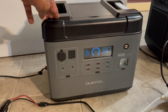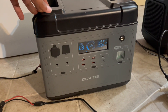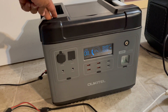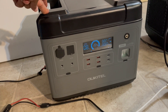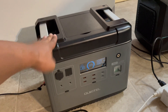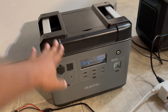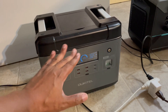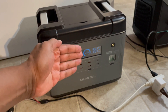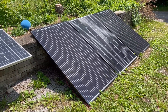In this situation you've got a 15 amp input limit. Those are like 9 amp panels — 9.8, 9.7, 9.2, something like that. So in this situation it would be 9 amps plus 9 amps, but that equals 15 because that is the limit on this device. Now realistically, how many amps are these panels putting out? Because very rarely do you get the full amp output on these panels — the amps fluctuate with various degrees of sunlight. Low sun and the amps are lower; high sun and the amps are higher.